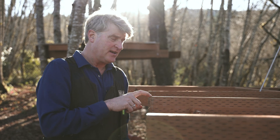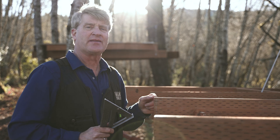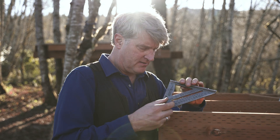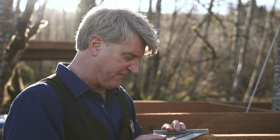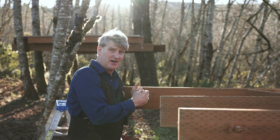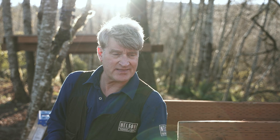When you have a situation like this — it's sort of a random angle — you're going to use your speed square once again to determine what angle you put on the table of your circular saw to make this cut. I'm going to come up to this with my Swanson speed square, and it shows about a 4-degree cut. You're going to do that for each joist, because they're going to be different often. Make sure you measure each one, then come back to your circular saw, set the table — in this case 4 degrees — and we'll come and cut that next.